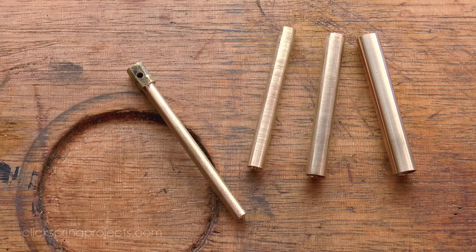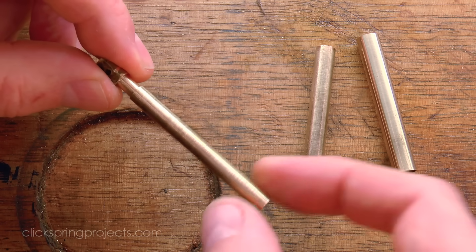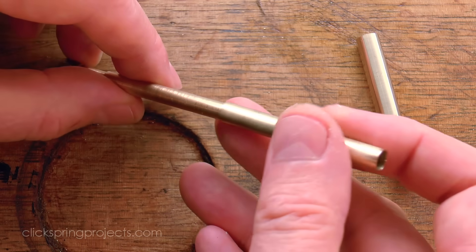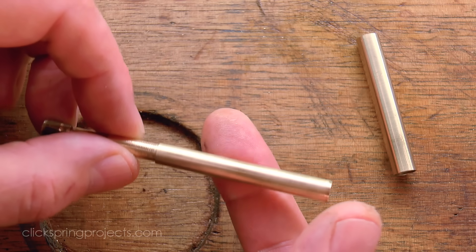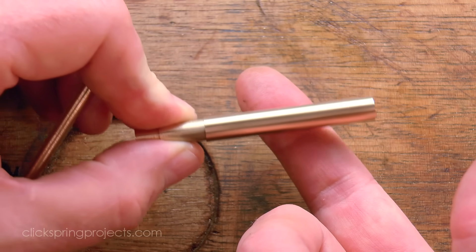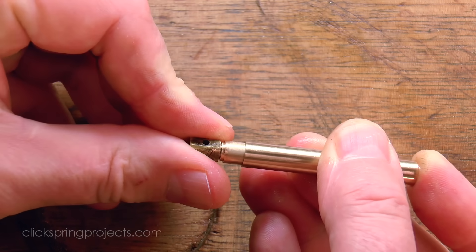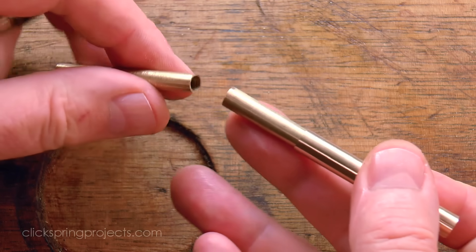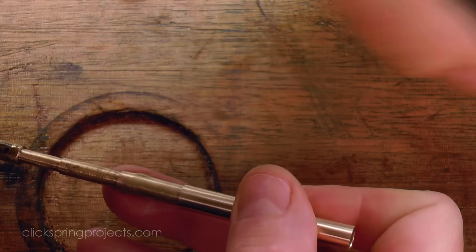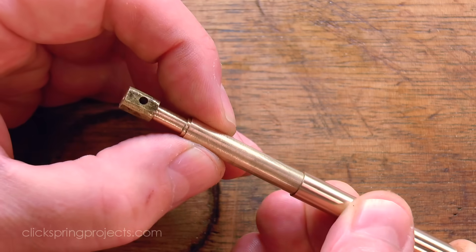Okay, so let's have a look at how the tubes perform. The idea that thin-walled concentric tubing should be a part of the Antikythera mechanism's conjectured planetarium display has been attractive to consider since it was first proposed by independent scholar Michael Wright in 2001. His idea has since been adopted as a critical aspect of many of the models that have followed. Much like for a modern watchmaker, a concern for any maker of this device is the management of friction throughout the mechanism's gear train and bearings, in particular the identification of any tendency to bind in the low torque sections of the train.